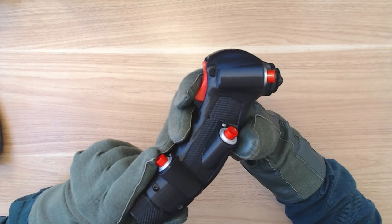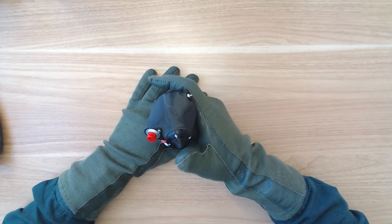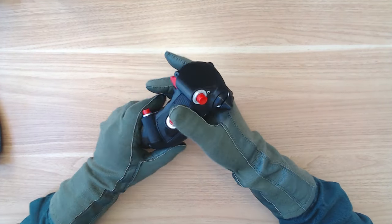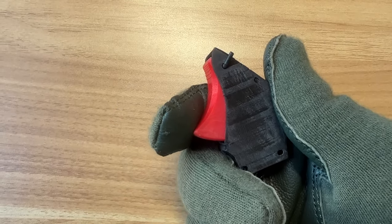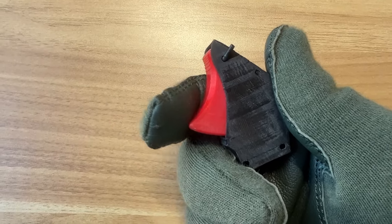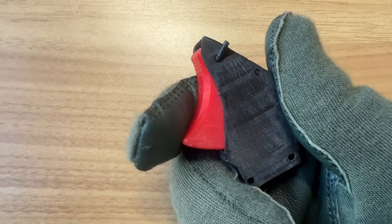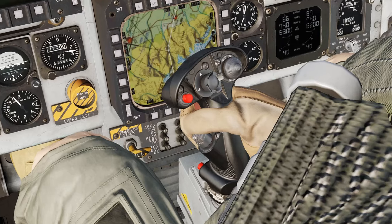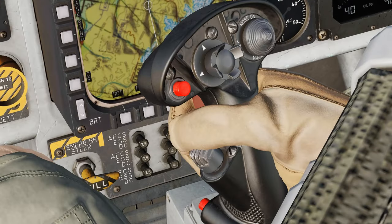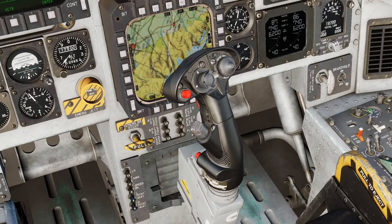To make a single stage, simply remove one of the tact switches. Need more force? Add another spring to the second stage, or insert a thicker spring entirely. There is an upper limit with this setup, however, as in order to approach real trigger forces, a thicker spring seems to reduce the tactile feedback of each of the stages. And that's really the kicker — real trigger forces far exceed what this module is capable of as is.